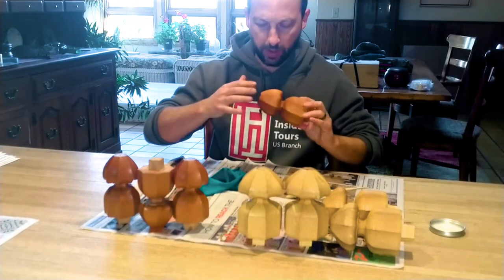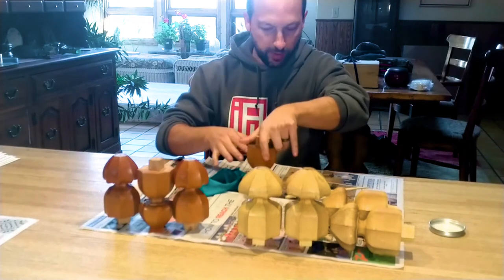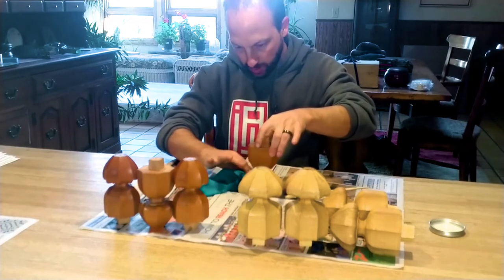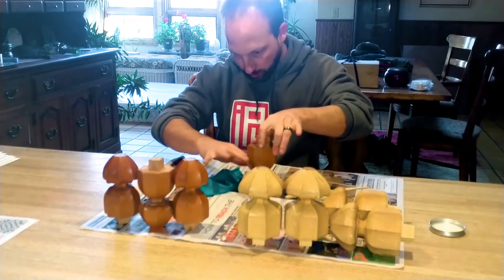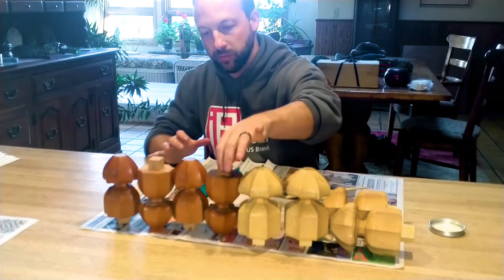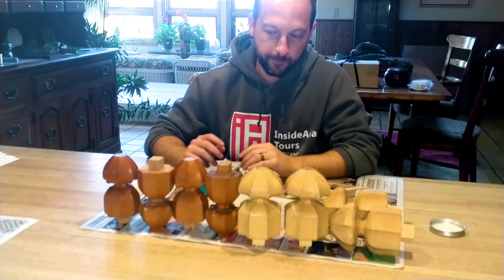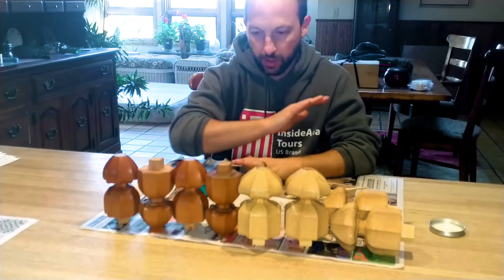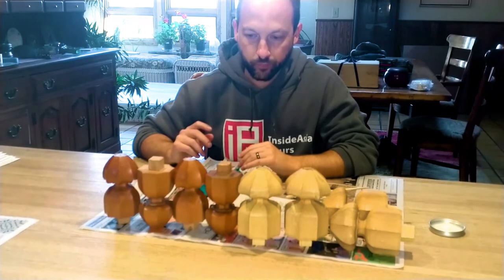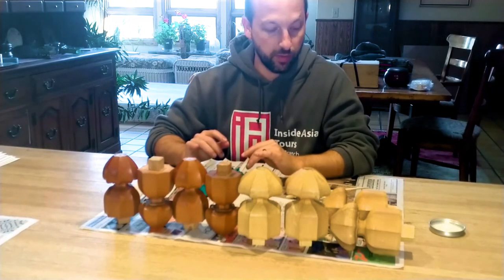You do kind of want to take off any globs you see, especially when it comes to wax and linseed. If it has any kind of solvent in it, if what you're applying can potentially change the color of the wood like linseed can, you do want it to be pretty evenly spread. And that's why a lot of people will recommend using a brush if you're just applying a layer of flax oil or boiled linseed oil or polymerized linseed. Go ahead and use a bristle brush to try to get a nice even coating across the entire surface of what you're working on. So we'll give that a minute, and we'll come check back in and wrap up.